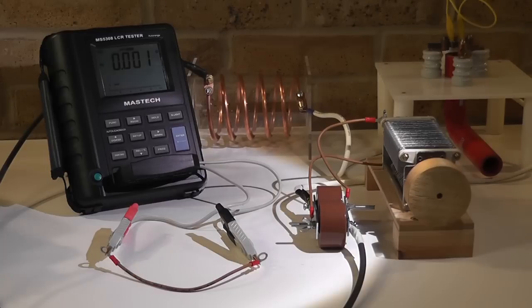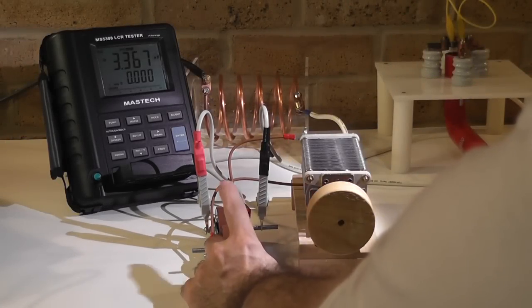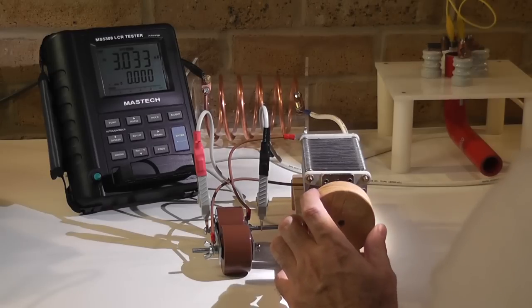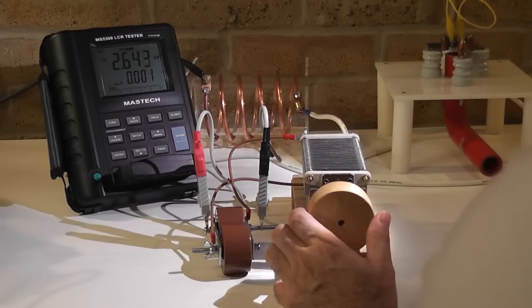It's very important in such a system to make sure you use the best and thickest cable with the shortest length. Otherwise you get errors in your calculations all over the place and you'll have a hard time finding the right values for your Tesla coil or energy system. Looking now at finding the right capacitance, I used two 1.4 nF capacitors in parallel for 2.8 nF, and I'm using my air capacitor as a trimmer. I have a nice ability to change capacitance, and we now have around 5 µH on inductance.